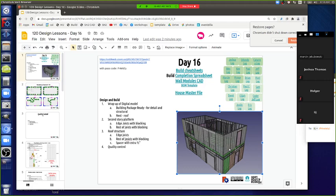We've got the main structure, structural members. The thing that's missing is details like the screw schedule. We didn't put screws into this yet, or a nail schedule, but that's something you annotate the drawings with, saying here are our screw schedules. Those are some of the outstanding details that would go into the build package that an architect would do. So we'll see if a collaboration with Bidema Architects can yield that.